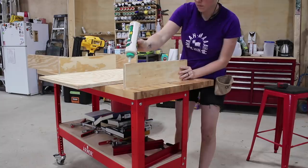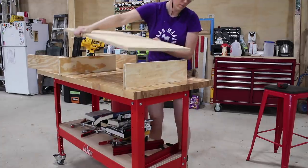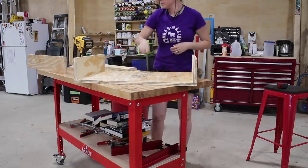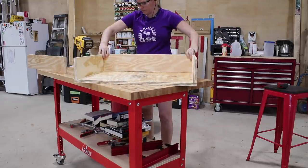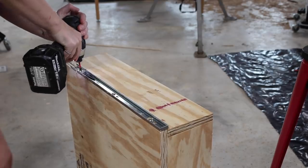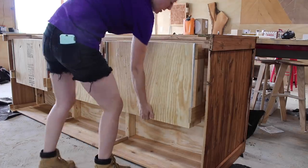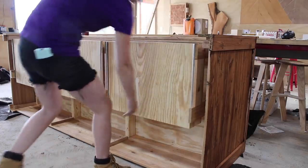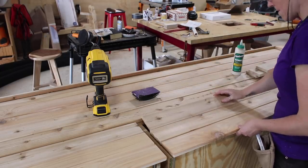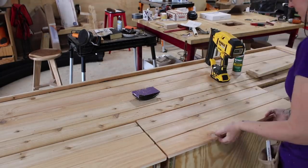I let the glue set up and moved on to making the drawers using three-quarter-inch material left over from the deck. I cut all pieces needed for three drawers and assembled them, then attached the second portion of the drawer slide to the two sides and mated the two together to slide the drawers into place. I designed the drawer faces to look like the slats above — took measurements to compensate for the reveals on all sides, cut them to length, rounded them over, and stuck them in place.